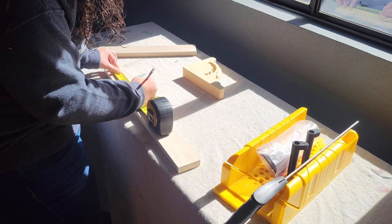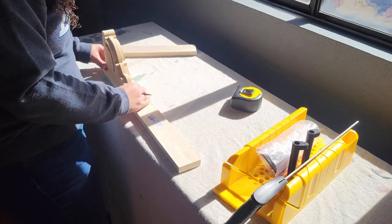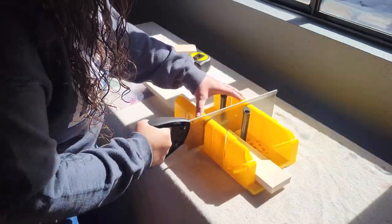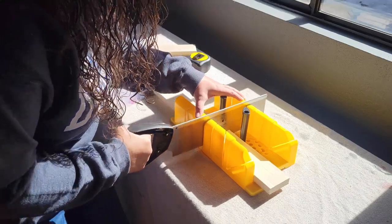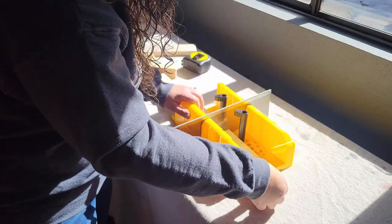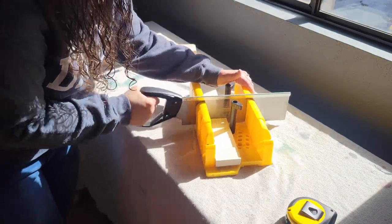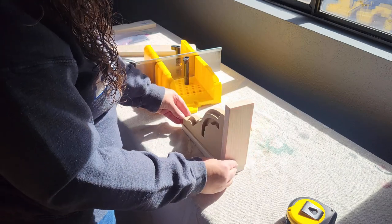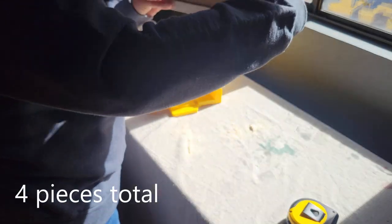I want to add these one-by-threes to the two outside edges of each corbel, so I'm measuring and making sure the pieces I'm going to cut are three-quarters of an inch longer than the corbel, giving me a little bit of overhang. I'm using my miter box instead of my circular saw — with narrow little pieces of wood like this, it's just easier to get a straight cut. I have a couple of different miter boxes; this Stanley one is better and comes with two black pegs that help clamp your pieces in place while sawing. I cut four pieces for each corbel, which took about a couple of minutes each.